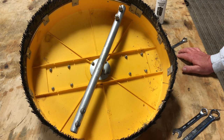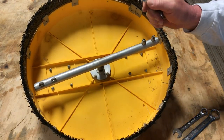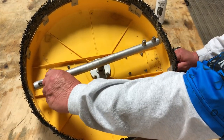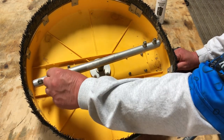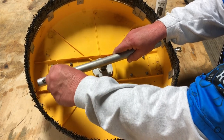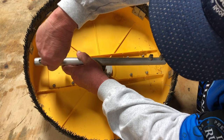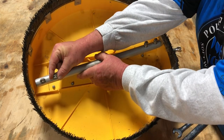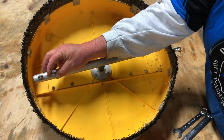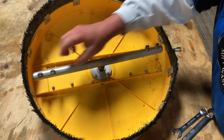So the big tip is just keep spare nozzles on hand. Use a 9/16-inch wrench — that's another thing you want to have on hand so that when you take these off, you have the proper wrench. Take it off, put another one in. When you put these back on, make sure you screw them down and get this little ridge — the ridge on all of these surface cleaner nozzles — lined up. You don't want it off-angle; you want this little ridge parallel going with the surface cleaner bar.